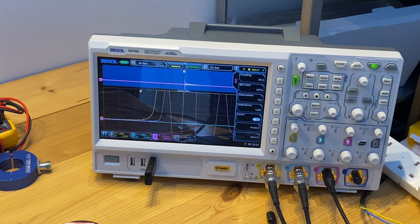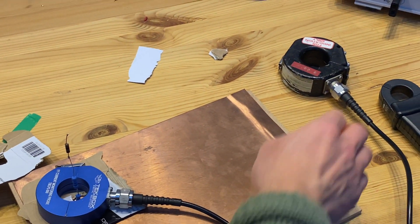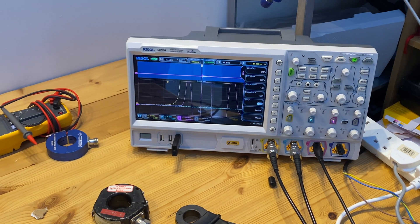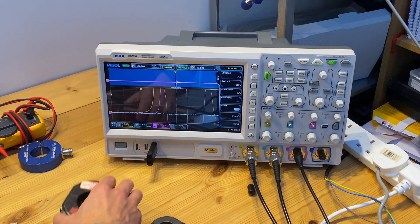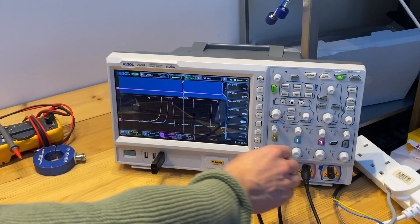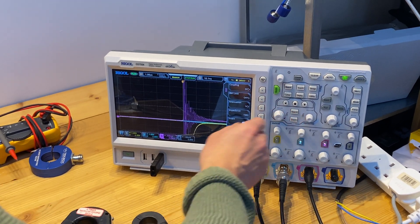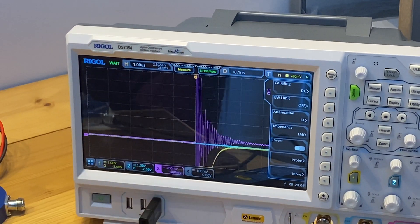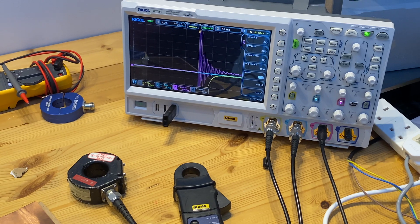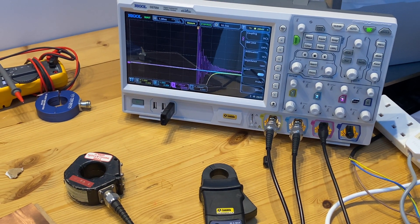Look — this is what we meant. We just saw an air discharge event into this circuit. Obviously this current probe will still measure the current; in this case the current is quite large and already over the limit of this scale. But you can see channel 2, which is this current probe, didn't pick up anything, whereas channel 3 using this probe picked up lots of noise as well. If I disable zoom, you can see the blue trace is at zero, whereas channel 3 has lots of ringing. This shows that this probe can do the basics up to DC to 100 kHz, but in terms of high frequency, the E-field shielding of this probe is not ideal — it picks up lots of fields in the ambient.